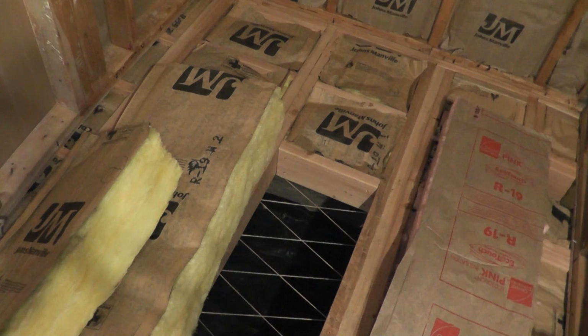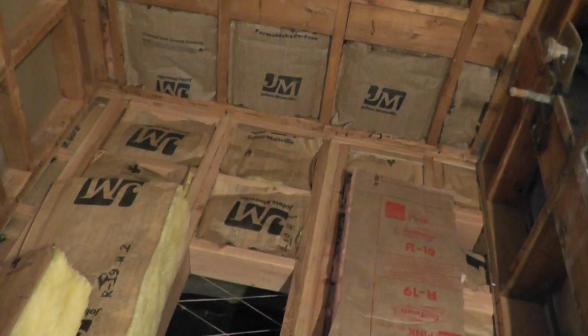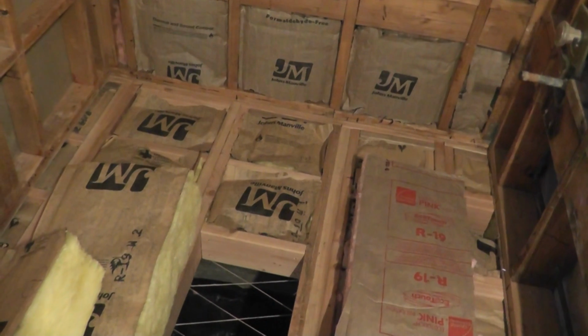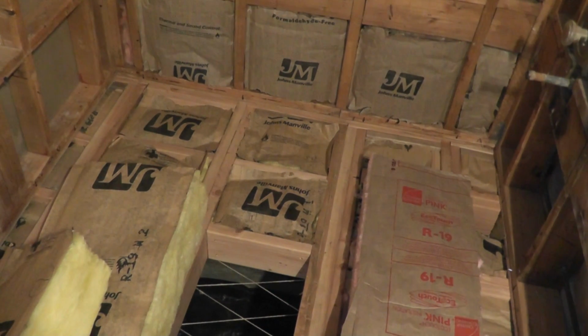Along the back wall and along the front wall, it's really hard to tell once again because of all the insulation that's back there, but I added a second row of blocking that butts up against that first row of blocking because I'm going to have to leave about a 1/4 inch gap between the plywood edge and the wall, so I want to make sure I have enough material to screw down the subfloor. What I did there was glue, and then I screwed through the face and then screwed into the side, into the floor joist there.